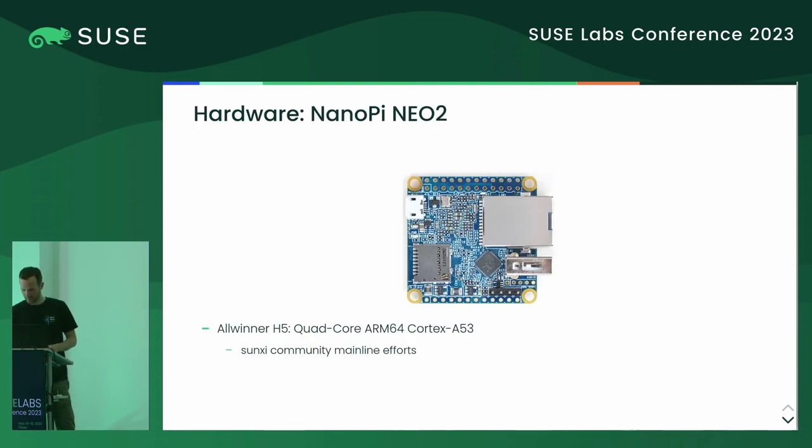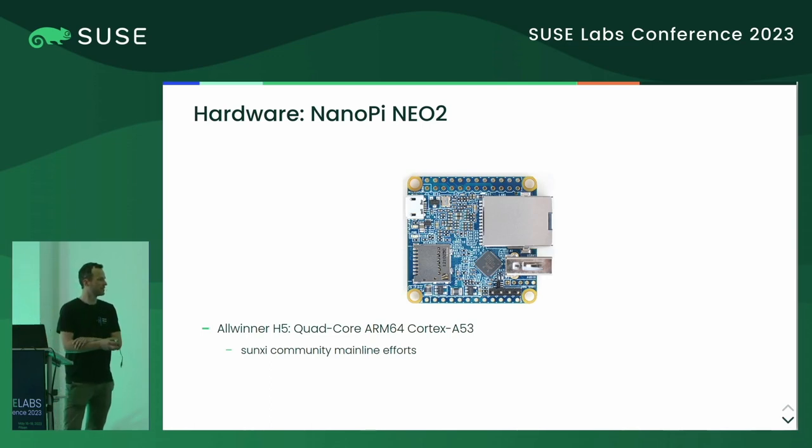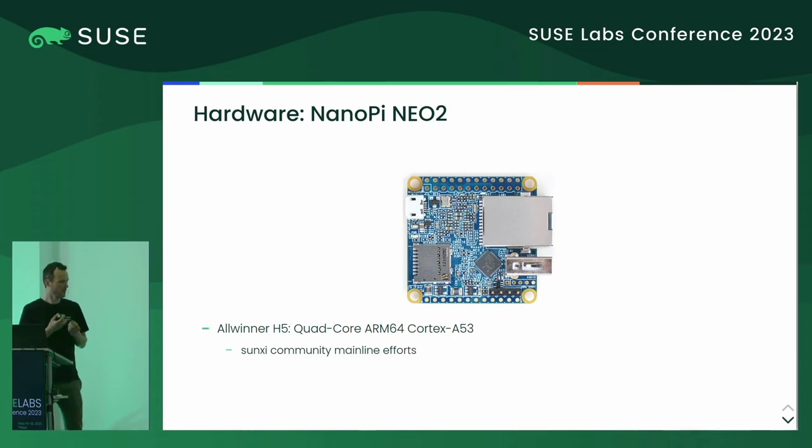So the hardware I have, I mentioned, something I already had. So it's quite old nowadays. It's around 5 years old or older. It's a 4x4 centimeter ARM64 board. It's got a few components which I don't really need for this project, the Ethernet and USB host ports, but Ethernet came in handy for debugging anyway, and it's of course also got UART on there, so I had a serial console.